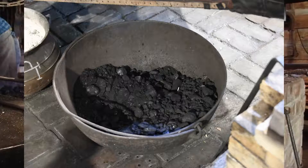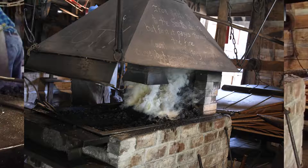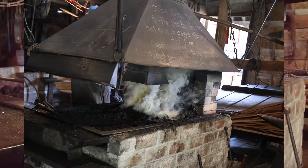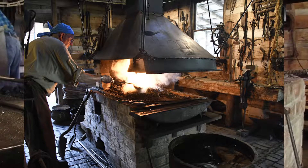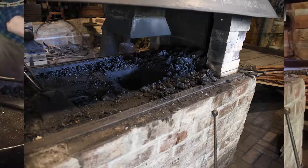The blacksmith starts off with coal — you can see a picture of coal here, shiny and dark. Then in the morning, he begins the next process: he changes coal to Coke. Not Coca-Cola like you drink, but Coke. You can see the coal start to burn, and as it burns, the volatiles and the water come off and go out through the vent, so that the blacksmith doesn't have to breathe those gases in. Then the blacksmith goes to the water barrel and starts pouring water on a portion of his coal, which seals the top of the mound by cooling it off. Inside that mound, destructive distillation — driving the water and volatiles off the coal — changes the coal to Coke.